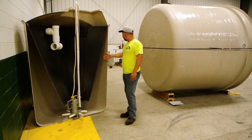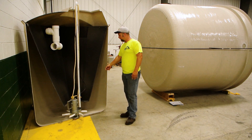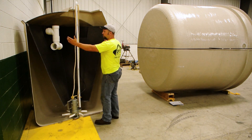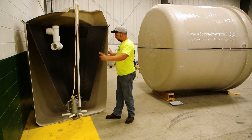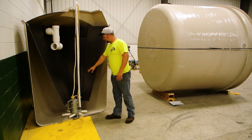The surge area on the outside is where the effluent comes into this area and gets processed. The inner cone is called the clarifier — that's where the cleanest water comes up and through, and the solids settle back down to the bottom.